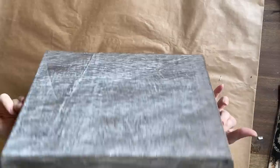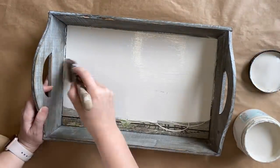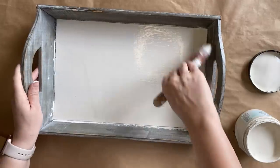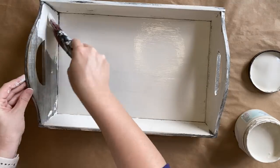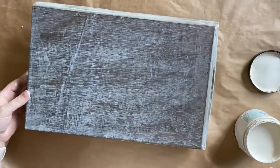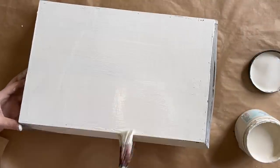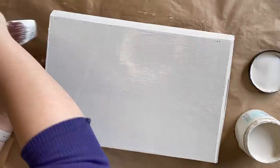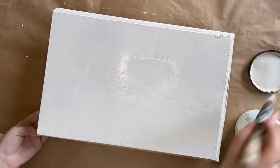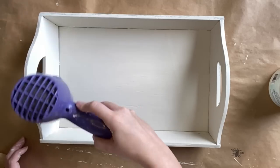Our next project is this little tray. I thought it was lovely to start off with but I just didn't like the lettering in the center — I wanted something more neutral. So I'm going to paint the entire tray with two coats of Dixie Bell's Endless Shore Silk Mineral Paint. Silk Mineral Paint has a built-in stain blocker so it's going to help block out the original lettering and any tannins that want to peek through on the wood. It also has a built-in sealer so I will not have to go over this with any sealer or wax once I'm done. I actually ended up adding a light third coat on the center and I'm speeding up the drying process to get a bit of a cracked paint effect — this is what happens when you speed up drying on a paint that has a built-in top coat.